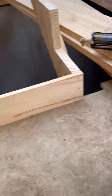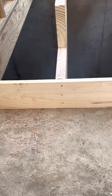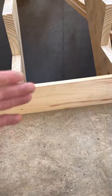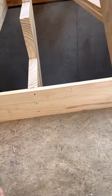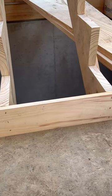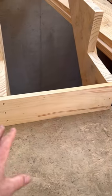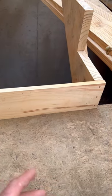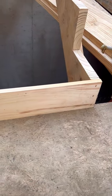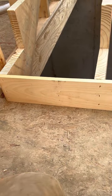So I'm gonna go through, put on all the risers, using just some regular old pine. These will get covered up with a veneer, some kind of finished, one-sided oak or whatever they use for their finished treads, or they'll get carpeted. Either way, I don't have to worry about this. It's not a finished product. I'm using a stapler and glue. If this were a finished riser, we wouldn't be doing it while we're rough framing, for one. But I would use a 16 gauge nailer to put on a finish riser.